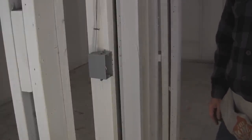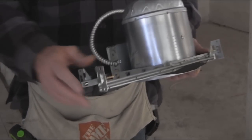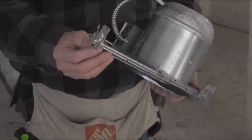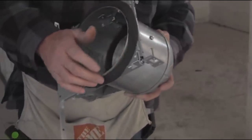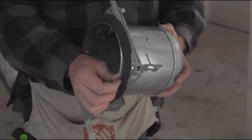Now we'll go ahead and hang up these recessed cans. I showed you the three-way switch, and the next thing we'll do is mount the cans. One thing you'll notice on these cans is they have nails in the end of them, and they also have a little tab right here so that you know you're getting on the bottom of the rafter. At this point we've got our airtight seal, and this is also extended down, protruded down, to sit on top of the sheetrock for half-inch sheetrock.